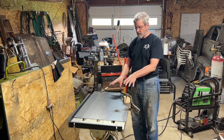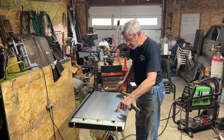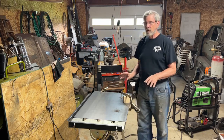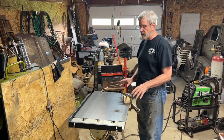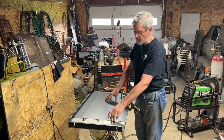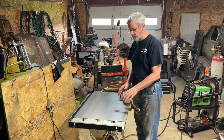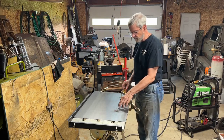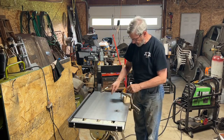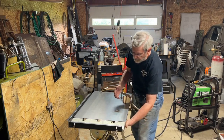Once I got this, I positioned it on the table, went underneath, and marked the slot with a marker. I determined that four-inch hole spacing, like typical welding tables, doesn't work well on this table without modification, so I didn't want to do that. Five inches between holes works out pretty well. I've marked it for five-inch spacing, and between those positions I've mounted a nut on the bottom — I'll bolt from the bottom up into that nut.